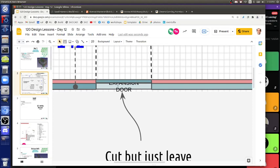Because remember, at the end of the day, your panels are sitting like this, over the pink. They're not load bearing on the pink, they're load bearing on the sill plate. Now here, this is the placeholder door. That actually does sit on the foundation itself, for which reason you need that plate that you cut out of the foundation and put on the side, and Ramset it in so that when you step on it, it doesn't fall down. So that's what's shown right there in that detail.